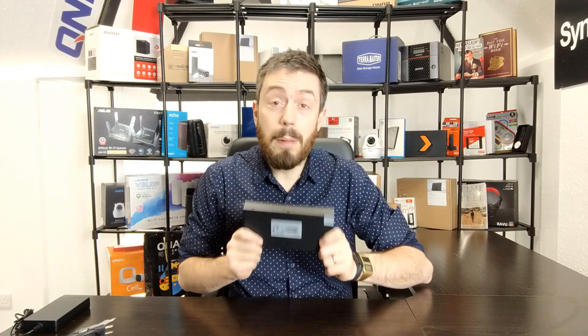That's exactly where a PoE switch is very useful. Even if you don't use it as your primary switch, you can connect it to an ISP router, a modem, or another switch and connect the cameras to this device at a single mains point. Cat6 cable runs up to 20 or even 50 metres while still carrying power to those external devices. You can feed cables directly into this switch and power up to eight external devices. Most external cameras use well under the 30-watt per port maximum, though some enterprise-grade klaxon-style IP speakers have a larger power draw.